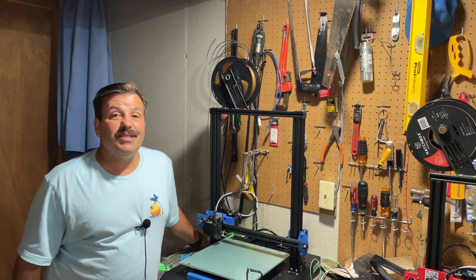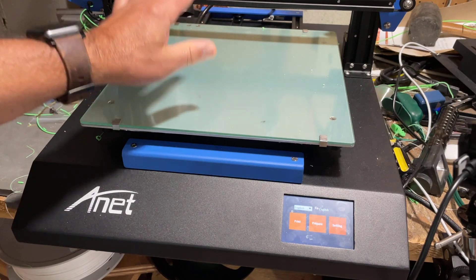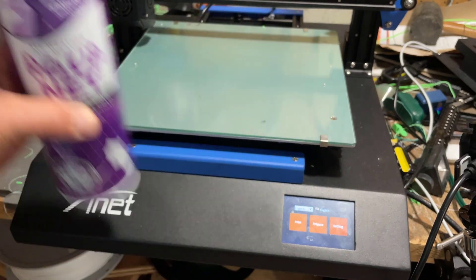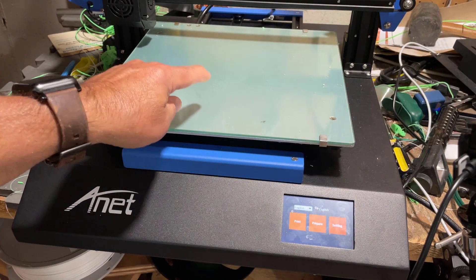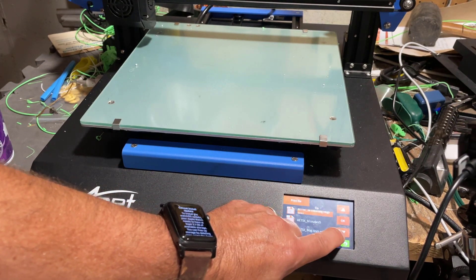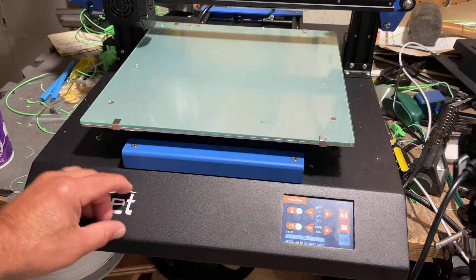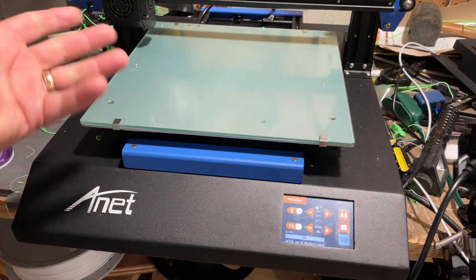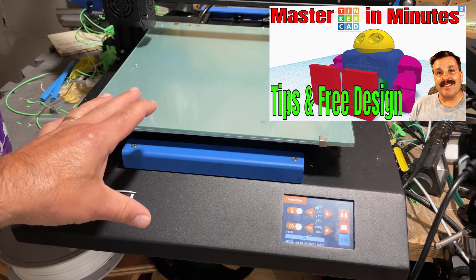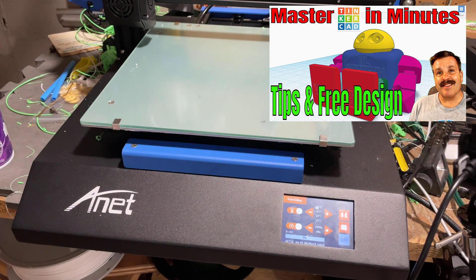When we're done it has joints that move, so let's get cracking. I am printing on the glass bed, which is what I prefer for this print. I'm dusting it with a tiny bit of Aquanet because of how small the arms are. We hit print, find the little robot I created, and hit OK. This is with PLA, so we're stress testing how accurately it makes it and if it's able to bend when done. If you haven't seen this tiny little robot, I have a video and a link so you can get access to it for free.